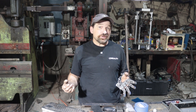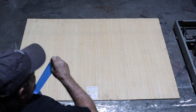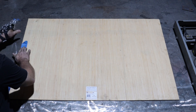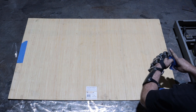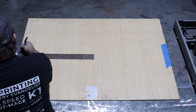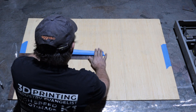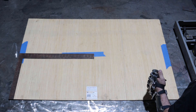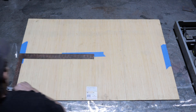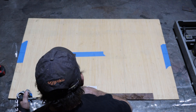I start this process by marking out the center of the engraving. This image will end up 30 by 45 inches. My material happens to be 32 by 48, so I have one inch by inch and a half all the way around. I start by marking the short axis of my workpiece with some two inch wide blue painter's tape, sticking a piece along both 32 inch sides and making a layout mark at 16 inches from the bottom edge. Next, 24 inches over, marking the center of the 48. The tape for the center needs to be at least 14 inches long so I can mark the center of the workpiece and also seven and a half inches left of center — this layout mark establishes the left edge of the center panel.